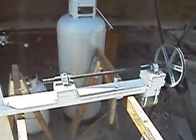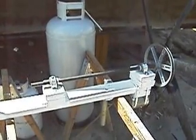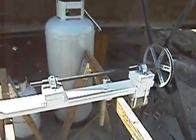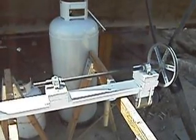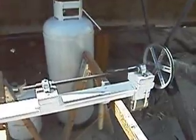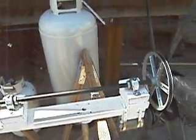The upper pulley was just put on with some parts I got at Home Depot for evaporative coolers. I think it's a three-quarter inch shaft and then two pillow blocks, three-quarter inch. And then these shaft collars here — one here and one over here — actually keep the shaft from moving or going off.